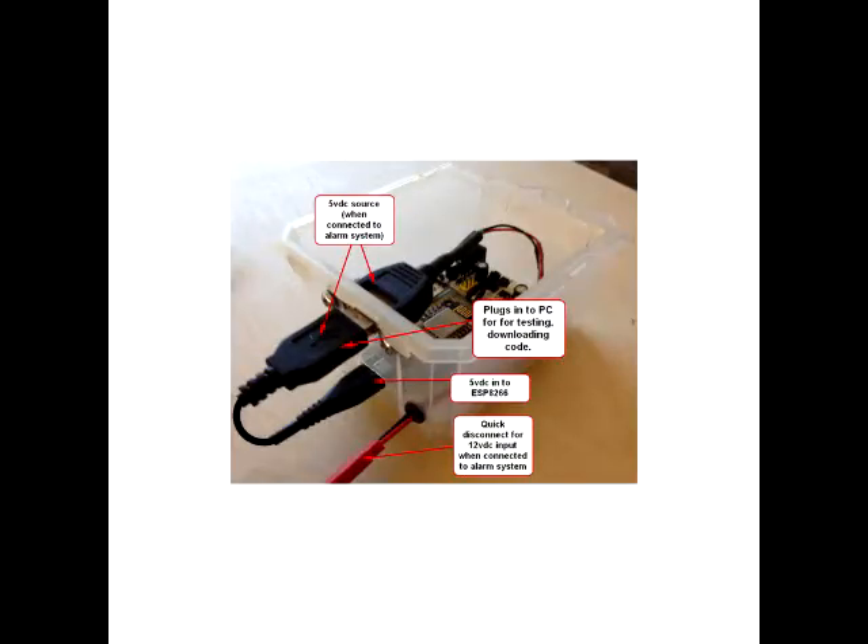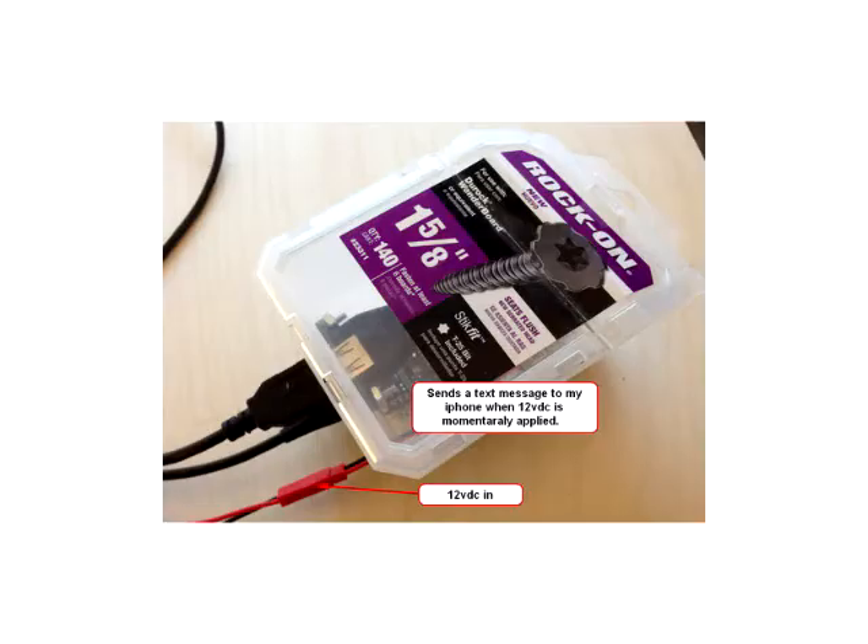I like to make stuff easy to use both on the bench and in operation. To that end, I designed this thing such that I could plug the A-type USB connector into the onboard power supply when in operation, but easily remove the unit to the bench by simply disconnecting the red connector which supplies 12 volt DC. Once on the bench, plug the A-type connector into my PC where I can fire up the Arduino IDE, alter it and download the code. Assembled, tested, all closed up and ready to run.